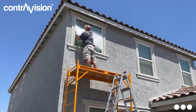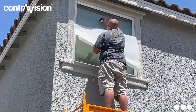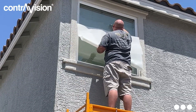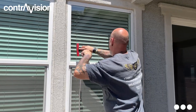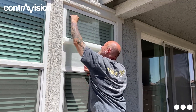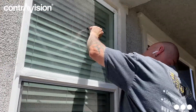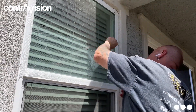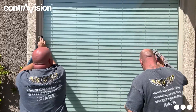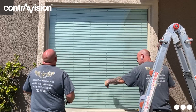The film uniquely features 0.08 inch diameter holes comprising 50% of the surface area, which maximizes through vision and allows natural light into the home, all with minimal impact to the appearance of the window. This waterproof polymeric perforated film is quick and easy to apply to commercial and residential exterior windows, and once applied has a lifespan of at least 3 years.